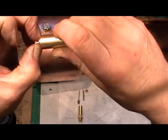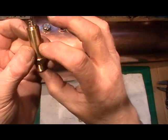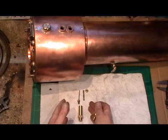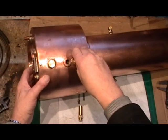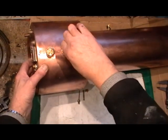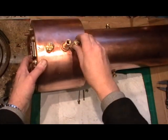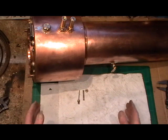I've got to make a tool to do this — I can't quite grip it with my fingers — but you get the idea. That's going to screw down to give me the correct PSI for the releasing of the ball for the steam. I've got the other one done identical to this and these just sit on top of the boiler like so. I think the pressure it's got to release at is 80 PSI, so that just wants to be set at 80 PSI now. That's another little job done on my boiler — another couple of fittings done.